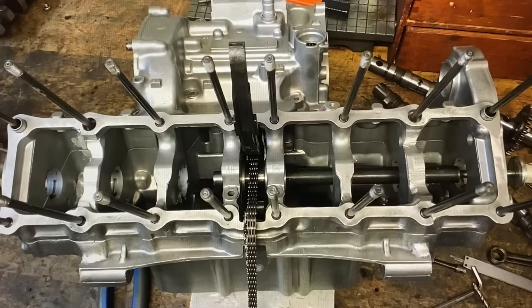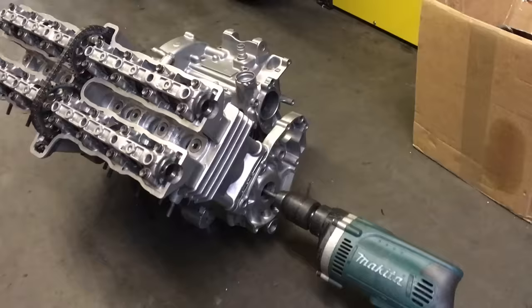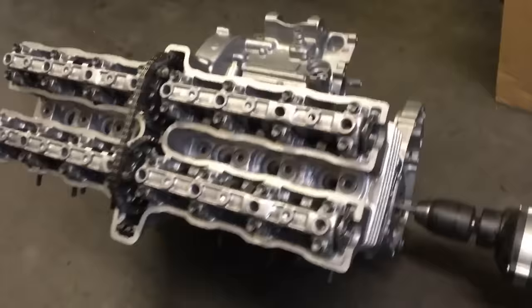The next thing I wanted to do was check that the camshaft drive system still worked with a modified engine, so I made up a temporary dummy crankshaft, which is a straight piece of bar with a cog in the centre, put on the chain and all the cam chain tensioning mechanisms, set it all up and spun it up with my electric drill.